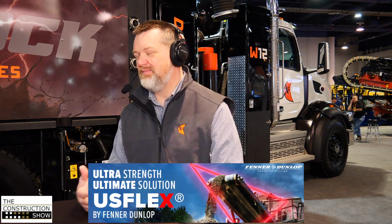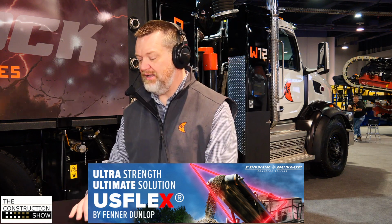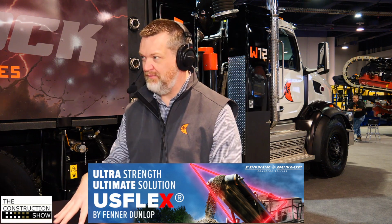So there's things that we do that are kind of jargon, and everyone's like, "Oh yeah, you know what that is," but when you're not in the industry every day, you don't always know. So potholing, daylighting, exposing utilities, those are all interchangeable terms. Basically, what you're doing is taking a utility that's under the ground and exposing it to daylight by taking all the dirt off the top of it. That way, you know exactly where that utility is.